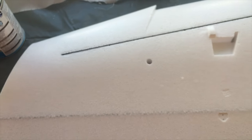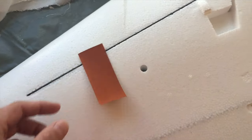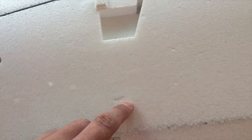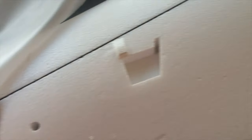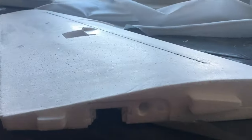Today's task is just to coat this part of the wing with fiberglass. The initial task will be to sand it a bit — I've got some sanding paper here, just to rough it up and get those dots away. Then I'll take the cloth and put it onto the wing. The only special things will be the dot for the servo. Most of the shiny surface has now vanished after being sanded, so the surface is ready to get coated. It will suck some of the varnish and glue it all together — pretty awesome, really clean smooth surface.